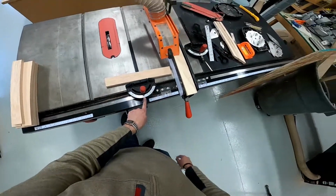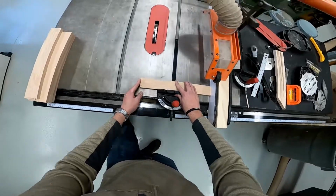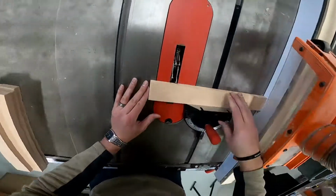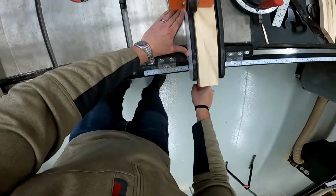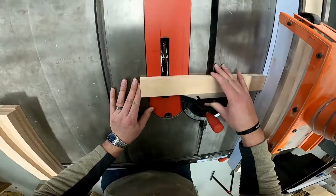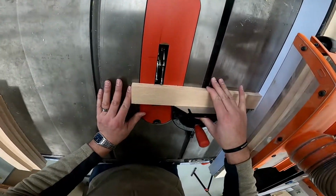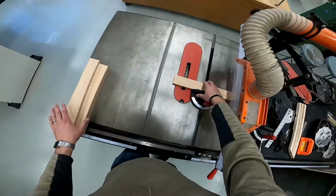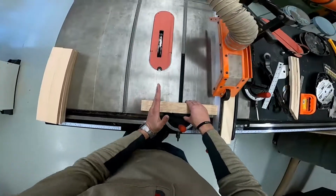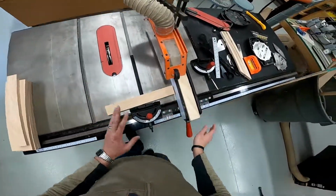Okay, we have our miter gauge set to 0, so it's not like basic where we had 8 degrees to the left or right. We want to be 0 this time. Okay, and then as far as the fence adjustment, I'm going by our pencil lines. Not sure if you can see what I see, but we're pretty darn close. Maybe a touch over. That's good. The most important thing is consistency. You want all of your legs to be exactly the same length so your dados all hit exactly the same spot. So when we start, we're definitely not going to adjust the fence.